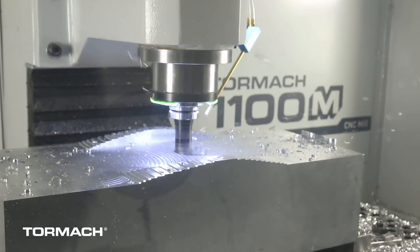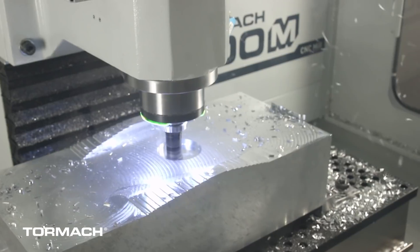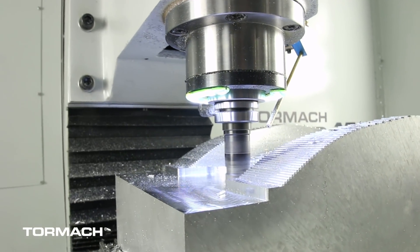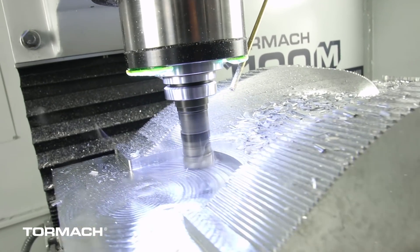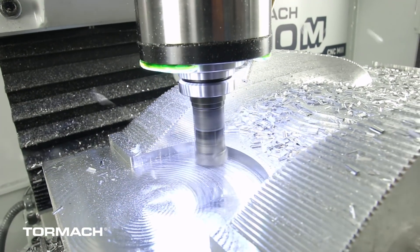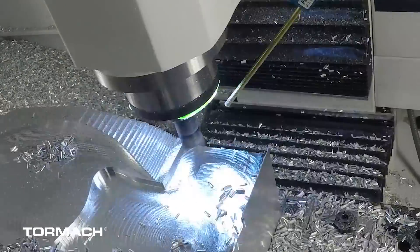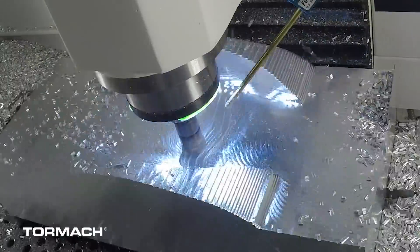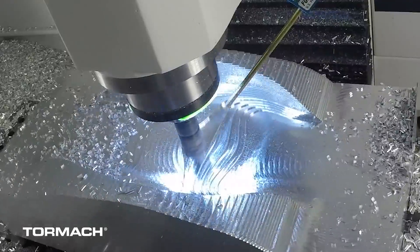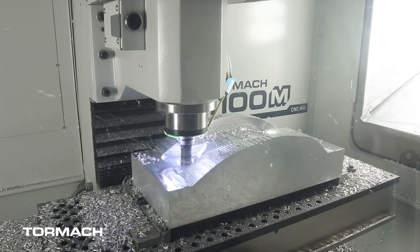One of the challenges here was that the part is the same size as the machine travel — an 18-inch part on 18 inches of X travel. Tool pathing was a little interesting because we had to contain the tool path in the X-axis, but we had enough travel in Y to run the tool off the side. We created some boundaries on the sides of the part — basically drawing big rectangles to keep the tool path out of those areas — and that worked really well. The tool path ended up starting in the center of the part rather than the outside of the block; ideally we'd have preferred starting outside, but it worked and we let it run.